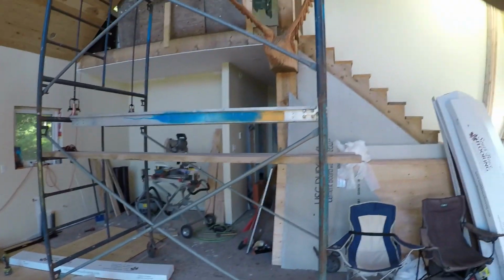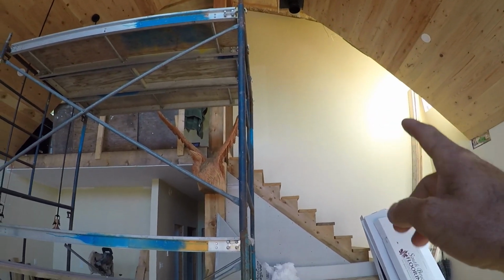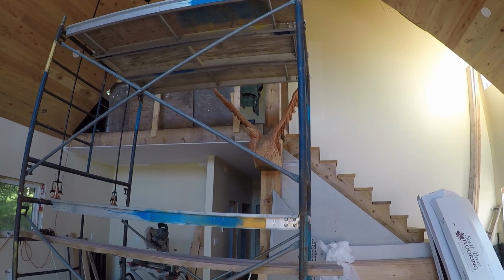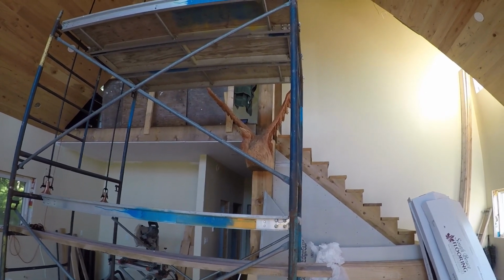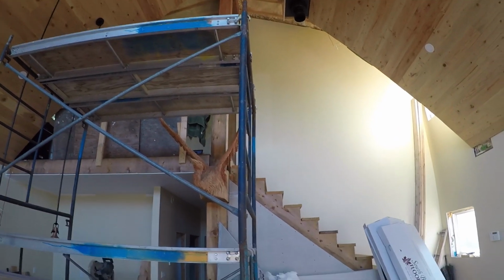It's just single wall pipe. I'm just going to hang those on and use some self-tapping screws to hang it down, because then when our wood stove comes in, I won't have to use a ladder or anything to get up to it, because it's kind of a precarious spot to get into, but I'll just be able to start working on it from the stairs there and just hang the rest of the pipe.